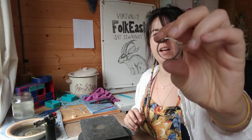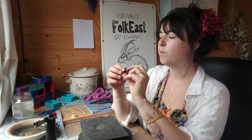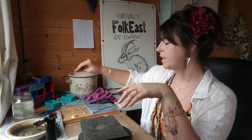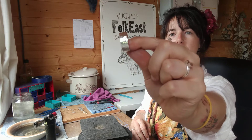There you can see the ring is done, other than it's got a grey-black finish at the moment which is the fire scale from when we fired it. To get rid of that you just need to pickle it in a solution — I've got my slow cooker which is just a salt and vinegar mix. We'll leave that for about 20 minutes and then the fire scale should just rub off. It will then go into a barrel tumbler, which is a little barrel filled with steel balls and shapes that get into all the nooks and crannies, really polish it up and make it strong. And then you end up with a super shiny one like this.